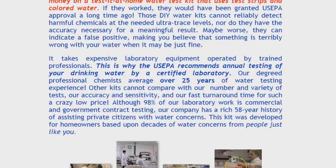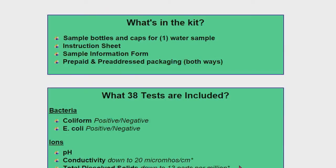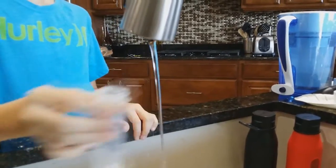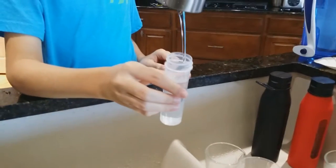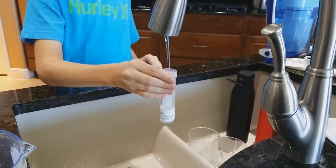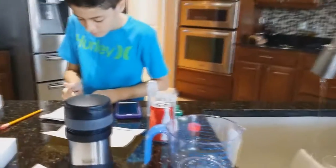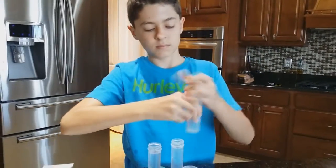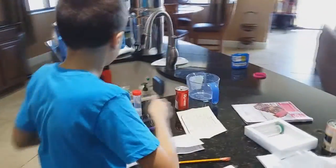They'll run all kinds of tests in their laboratory with actual measurements that you couldn't possibly do at home with any type of meter. We did a TDS — total dissolved solids — which you can get commonly. That uses two electrodes to check the number of dissolved solids in the water by passing a current through it. You can also do moderate pH testing. As far as conductivity, total dissolved solids, bromide, chloride, fluoride, and all those things that may or may not be good for us — it'll tell us all the way down to 0.1 parts per million. It'll also give calcium, iron, magnesium, potassium, and sodium measurements. You can look at their website: KARlabs.com. Look at the test kit for forty-nine bucks — they do some other stuff too.